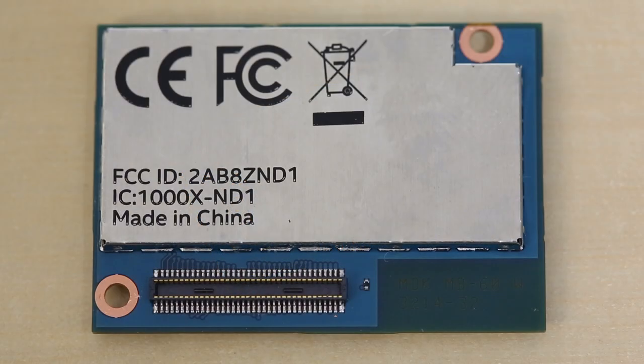It also contains a Wi-Fi and Bluetooth stack with an onboard antenna and UFL connector. To power it, you need to provide 3.3 to 4.5 volts input — no 5 volts unless you want bad things to happen.